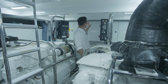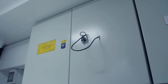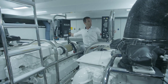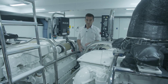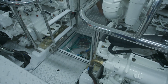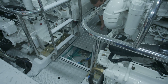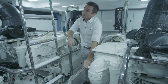On the forward bulkhead you've got all of your electronic distribution behind panel doors - DC on the starboard side, AC on the port side - really accessible down the centre line. Outboard of the engines are two diesel fuel tanks giving a total fuel capacity of 6,000 litres. Moving aft, the tread plate lifts up easily to access even more sea cocks and strainers for cooling systems including the optional Sea Keeper stabilizer, water maker, and hydraulic systems running bow thruster, stern thruster, and windlasses.